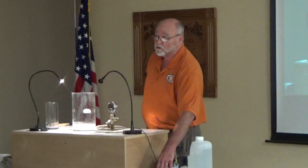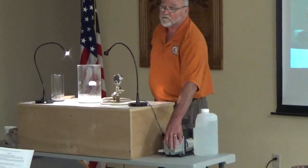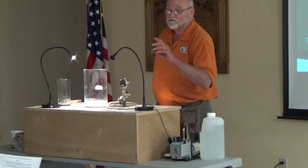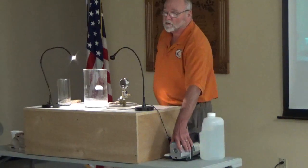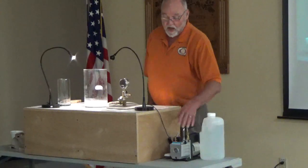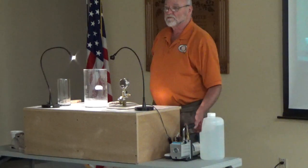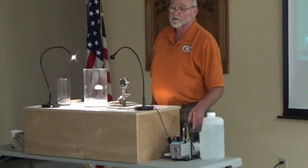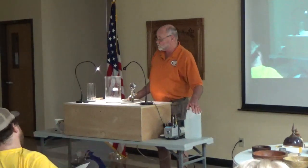You can tell the difference in the pump by the glass, because there's gonna be a window in the front, and it's gonna have oil in it. Okay? There's 2 things to remember about these kind of pumps. They get warm to touch. You're gonna touch it and go, that's hot, I'm gonna blow my pump up, I'm gonna turn it off. Well, they're made to run like that. Don't turn them off. They're fine, but they will get up around 200 degrees. You gotta remember that temperature, because that's important to the resin. Okay?